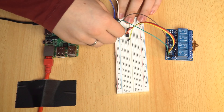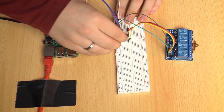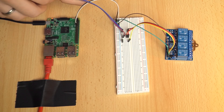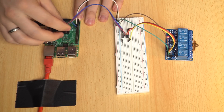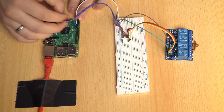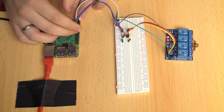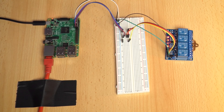We are using a relay board with four relays but using just three GPIOs — we'll explain that later. We are connecting relay 2 and 3 together. The first relay is connected to GPIO13, the second and third relay to GPIO15, and the last one to GPIO16. So we have connected all three relays to our GPIO board.